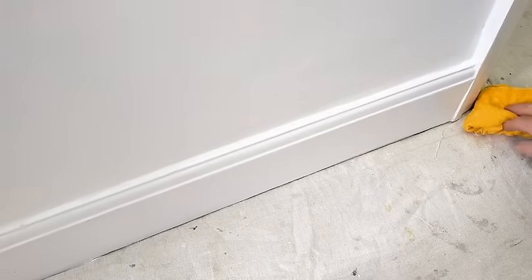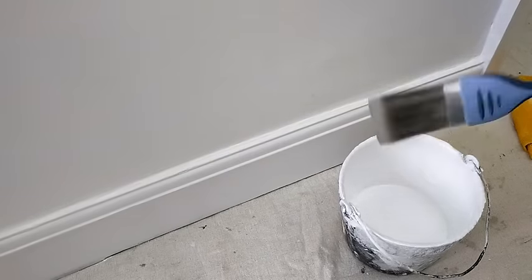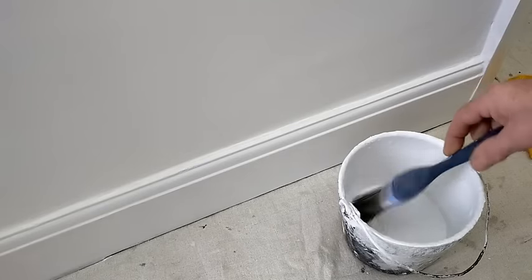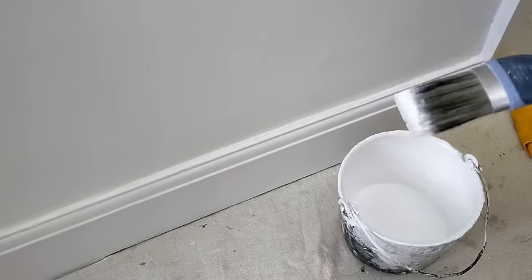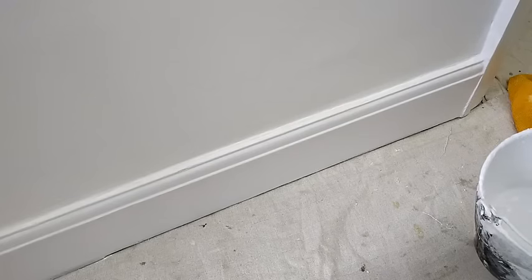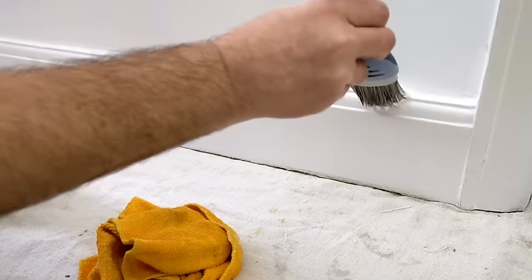If you need to, use a damp cloth to come back up on any edges. Same again but I'll use the two inch this time — remember to work some paint into the filament. No drips coming off there. Get a bit closer — the two inch brush won't be carrying as much paint as the three inch, but still starting a little way out on the top.